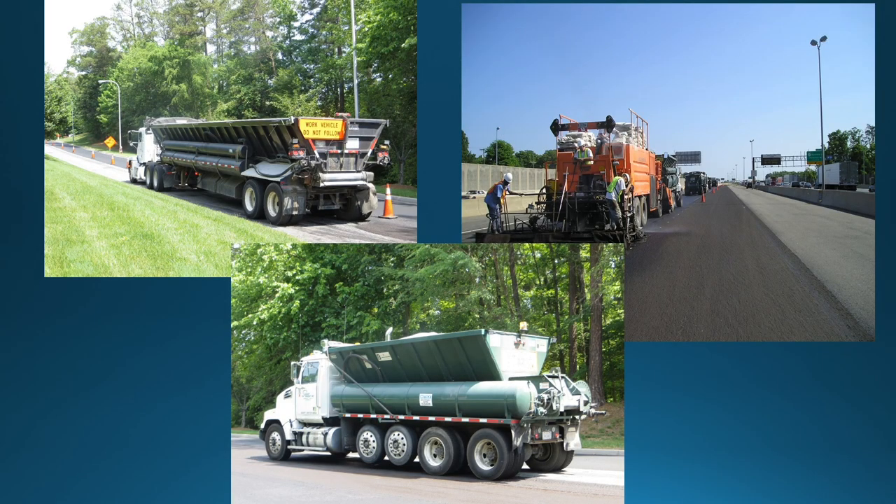Just a couple of differences between the continuous-run operation and the truck-mounted pavers: you've got different-size support units, whether a trailer-mounted unit or a tandem-size unit. But you can stack them all up in front of a continuous-run paver and, for all intents and purposes, put enough material in front of that paver to go for quite a ways without having to recharge the paver or construct a transverse joint.